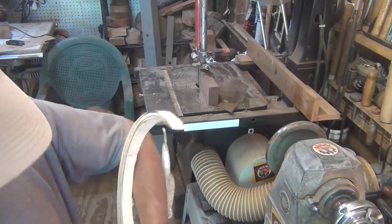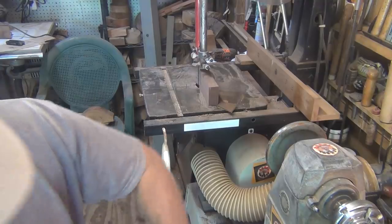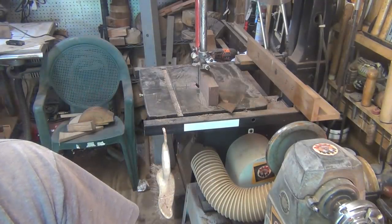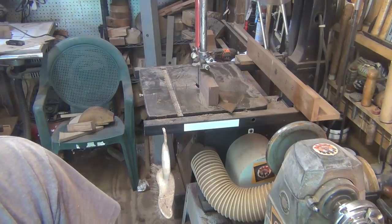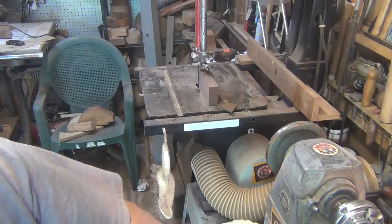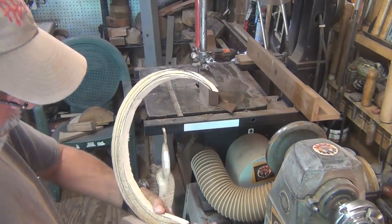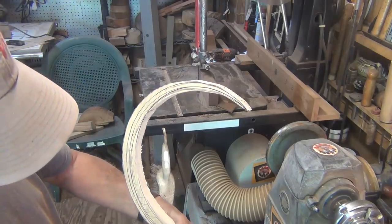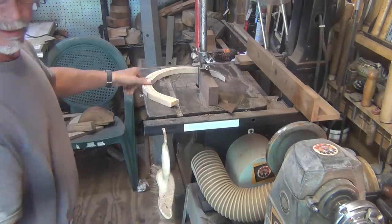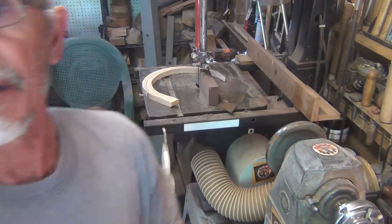So I'm going to notch this, slide this, and then contour this, and the foot to its proper profile on here. Mount it up. The axis will be important on how I put this, but I will radius this down to die into nothing over here. And the way I'm going to notch this out is on my radial arm saw.